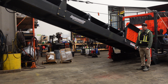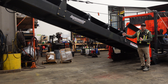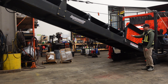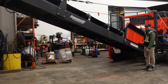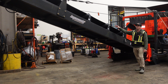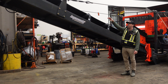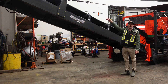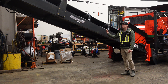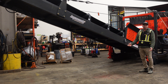The conveyor on the SD300 is a 20 foot long conveyor with a 24 inch wide belt that's quite heavy. It has a large impact bed underneath where the large rocks tumble onto the conveyor, and fairly heavy rollers going up the conveyor. At the very top we have an electric drive motor with a gear reducer directly mounted on the shaft driving the head pulley. All the parts on this are top quality and built to the same standards as our larger machines.